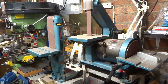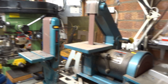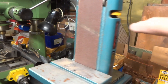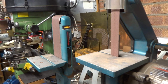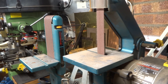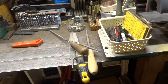On the subject of cleaning up flashing from castings, I find two of the most useful bits of gear in the workshop are, in fact, the belt sanders — I've got a narrow one and I've got a wider one. I've never been much good with a file, and I find these things absolutely a boon when making a start on things that have got flashing or aren't quite square. Obviously, ultimately you probably need to have a bit of a touch up with files, but I try to minimise that because I ain't no good at it.